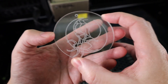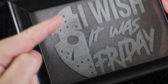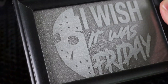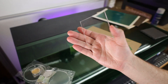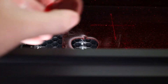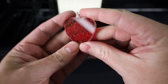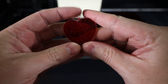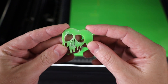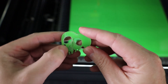Here it is with all the paint washed off, and you can see it looks pretty nice. If you are brushing on your paint, just keep in mind that it can transfer the pattern from your brush into the engraving. You can do the same process on clear acrylic, but you're not going to be able to cut it using a diode laser. You are able to cut clear red acrylic, and it does a pretty decent job with larger cuts and basic shapes, but it does kind of struggle with thinner details — you can see that on the top part of this apple, how it's broken and the edges aren't as clean as they could be. You're also able to cut opaque acrylic, but it still has problems doing thinner pieces. I'm sure I could fine-tune the settings a little bit better, but I just wanted to show what limitations you might have if you're doing acrylic stuff.